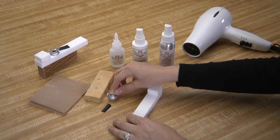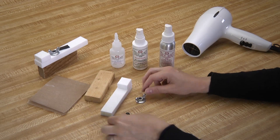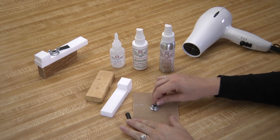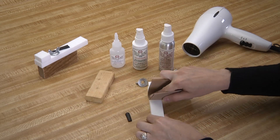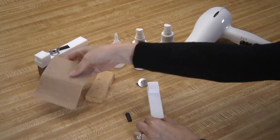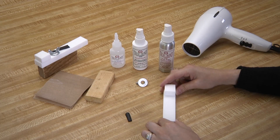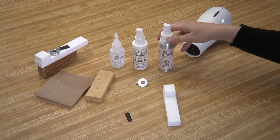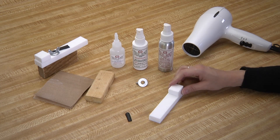Next, we are going to bond both metal and rubber to our Teflon base. Before starting, make sure all surfaces are clean. To get maximum strength, both the metal and the Teflon need to be roughed prior to bonding. Then saturate the Teflon with the poly prep and let this dry. The poly prep will dry the oil on the poly surface and etch the surface — it is solvent based, so it will dry quickly.